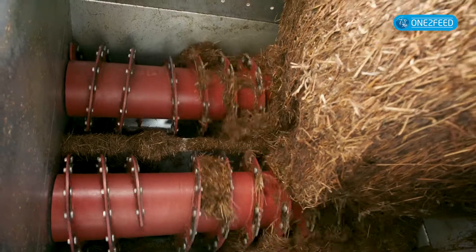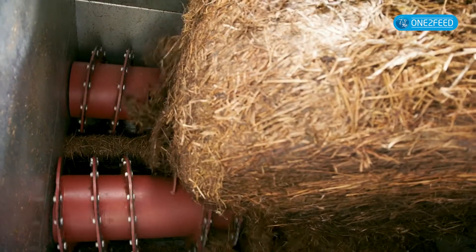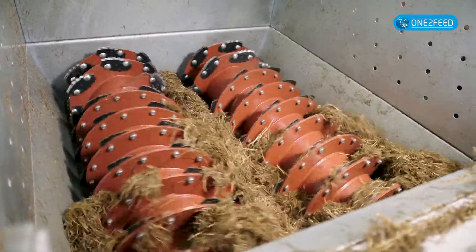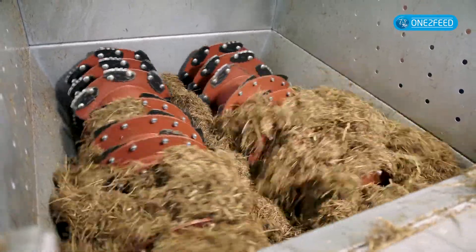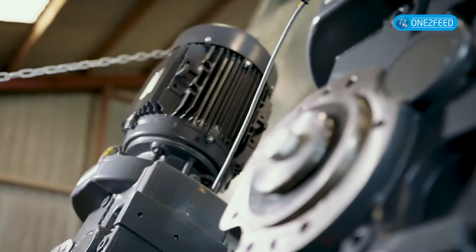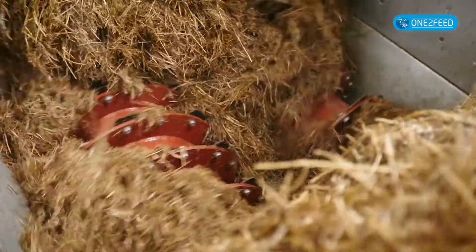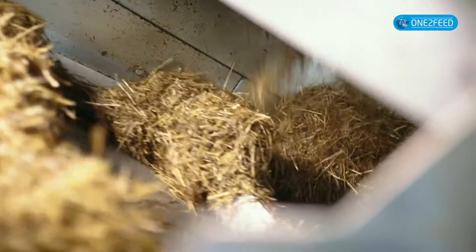The cutter itself has two augers of a diameter of about 500 millimeters. Each auger has about 100 knives — big knives with two bolts so you can turn them around — and the electric motor is 5.5 kilowatt, one motor on each auger. The mixer itself is at a slight angle so this ensures that you have a constant flow out of the auger.